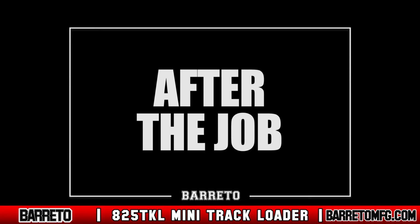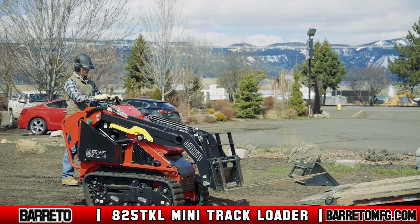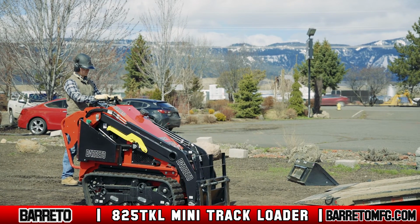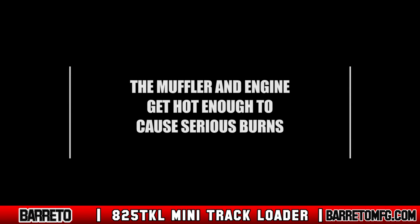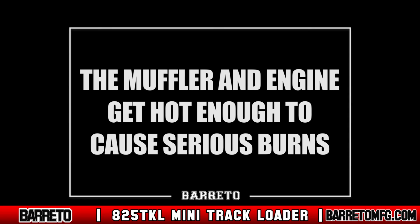After the job. Once you're done, move the loader to level ground and park. Never park on a slope. Turn off the ignition switch. Never leave the machine running unattended. The muffler and engine get hot enough to cause serious burns.